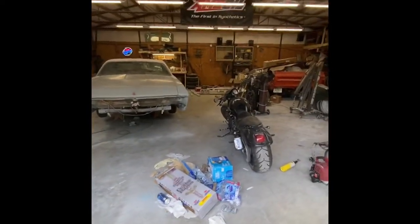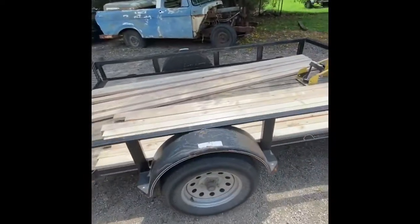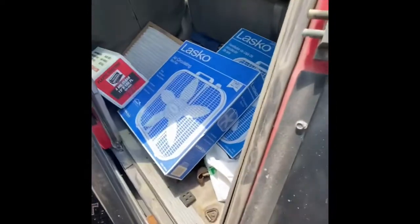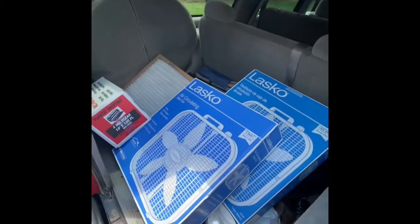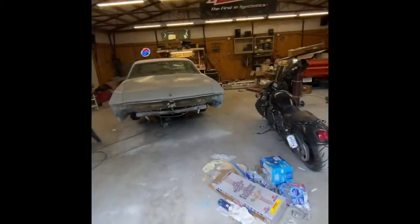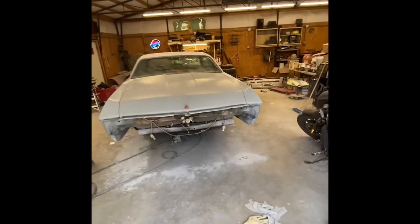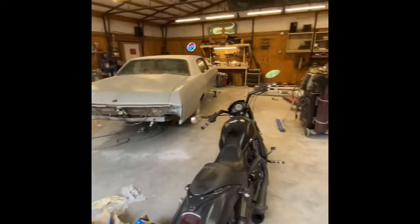The plan is to make it about 16 by 28, which I've got plenty of room for in here. I went to Menards and got some lumber, so I'll put some boards across the top to support the walls to each other. I got a couple of box fans, some heavy mil plastic to make a roof over the top, and a couple of filters to blow the fans through so bugs and dirt don't get blown in. A buddy of mine's got a 110 air conditioner he's not using, so I'm gonna mount that in the wall and hopefully have an air-conditioned paint booth.